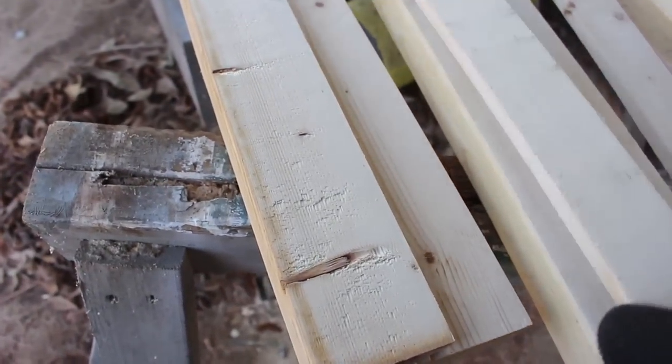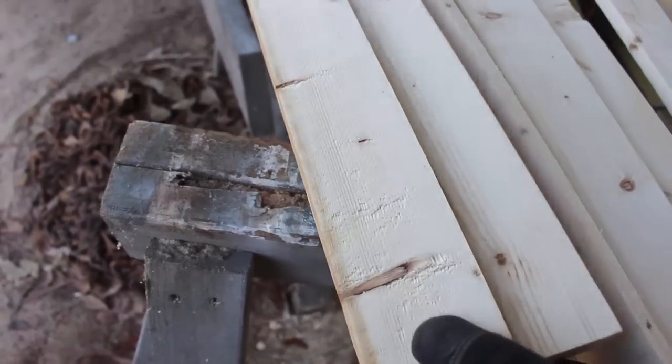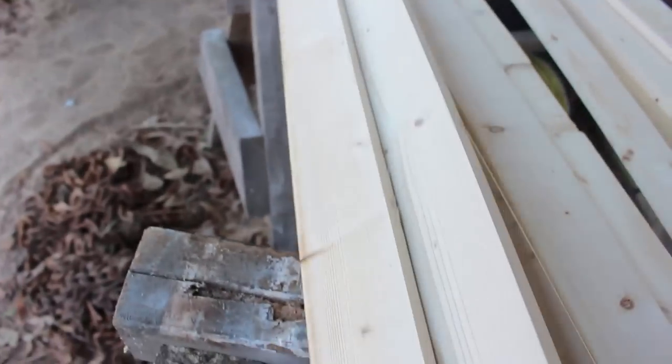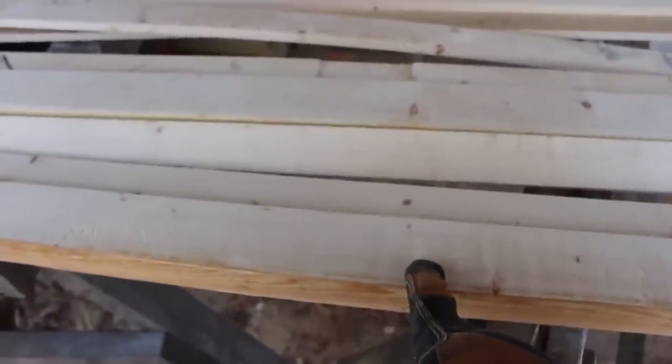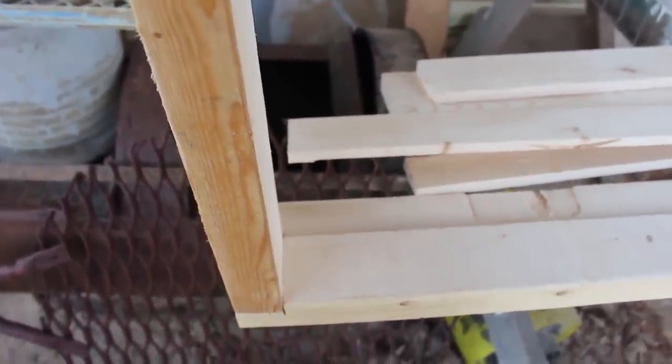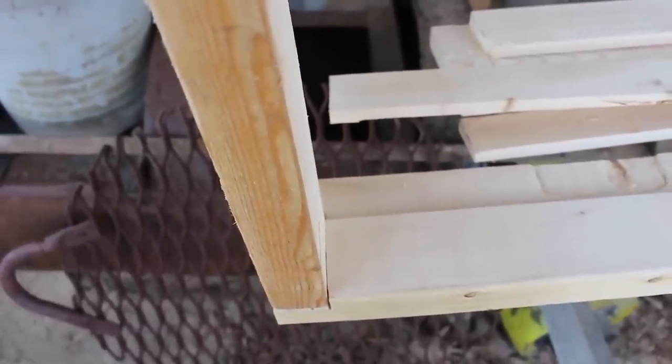I ripped the top piece the exact same way as the two side pieces - you can see it has the half-inch deep groove on the end as well. Once I had this piece cut, I cut it one-eighth of an inch longer than the width of the door. This was a 30-inch door so I cut this 30 and one-eighth of an inch because I need a little bit of gap around it. Then I took the small ripped-off piece and stuck it on the end to mark where I needed to cut the corner.